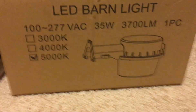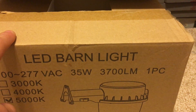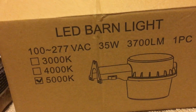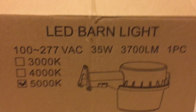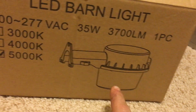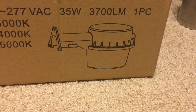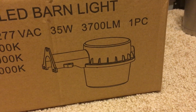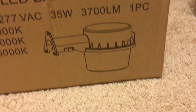There's a box, so we'll go outside and take a look at it. The light does not have a light sensor on it — this particular model is a motion sensor light only. It only turns on whenever there's motion, and it doesn't turn on to ambient motion, which is nice. The motion sensor is inside the light; it's a microwave motion sensor. It's pretty bright as well. You can also change the sensitivity inside the light itself.